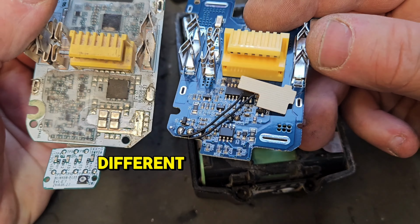About half a volt in that bank of cells. Half a volt in that bank of cells. And last but not least, about half a volt in that bank of cells as well. So that's where your 2.5 is coming out. It's getting about half a volt in every bank.